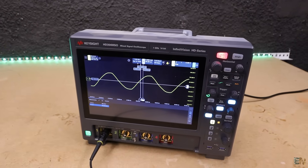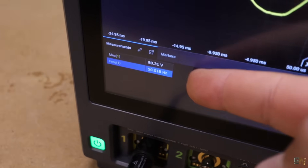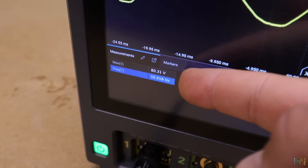The signal, as you have seen, is 80 volts and 50 Hz for this specific film. By the way, if you use DC voltage with this film or any other LCD, what will happen is something called permanent polarization — basically all the crystals will stay polarized in the same direction forever. So we don't want to do that.